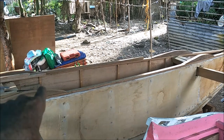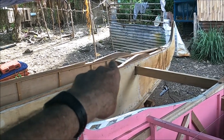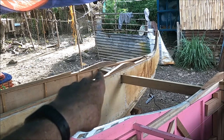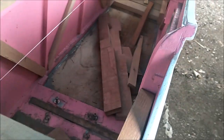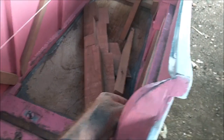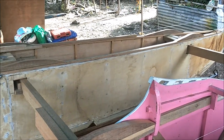And then after all that's in, there'll be a one piece continuous one on top of that, running the full length as far as it can up to that front cross beam brace, and on both sides and in the front too. So we'll double up basically like this, where we've got this 1x2 and this 1x2, doubling up on those all the way around those holes there. So that's our next step.